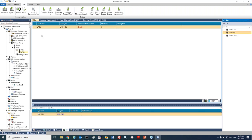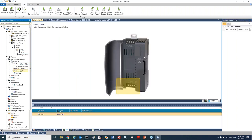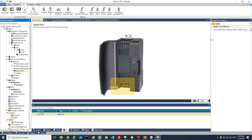A new line with the VFD will be added. We can change here the Modbus ID for the VFD. We can change the name here. And we need to set the communication channel to the VFD. So again, I will go to the Solution Explorer, PLC communication, serial com, and on the right side,